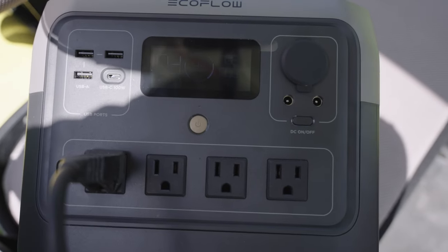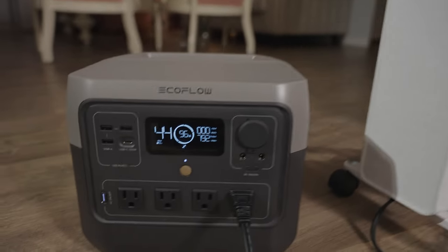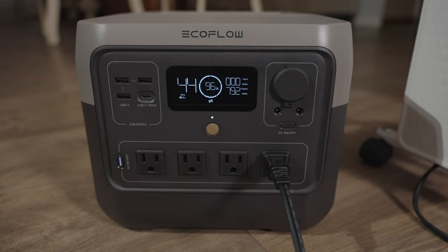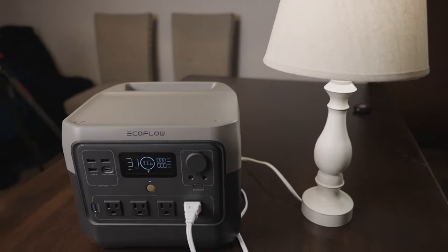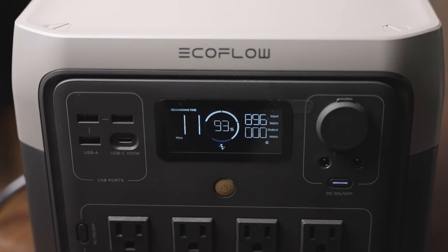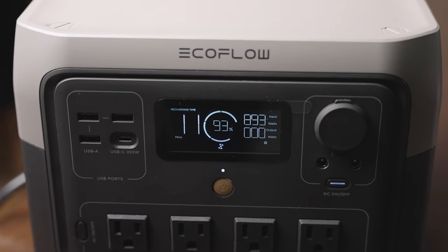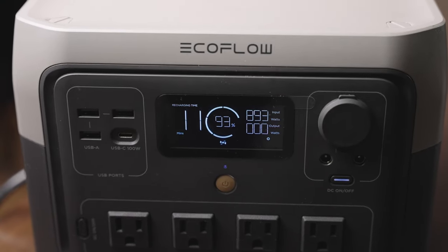I powered a jigsaw for about five hours. I also plugged in a giant heater drawing 792 watts — the battery dropped to 96% in just a few minutes and it's going to be able to power it for another 44 minutes. I can power a standard desk lamp for 31 hours. When I plugged it into the AC outlet to charge from 90%, you can see the input wattage changing as the BMS — the battery management system — regulates itself to safely charge at the fastest rate possible.